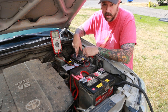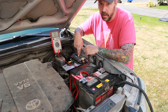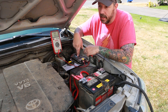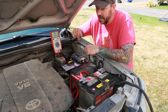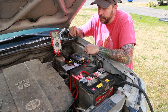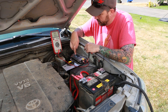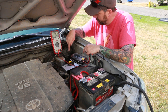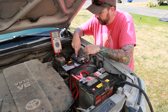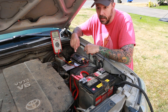Now we'll hook up our accessories to the block. I have two accessories that I've actually unplugged from the battery terminal that I'll get hooked up to our new fuse panel, and in the future we'll have other accessories. I don't know how long I'll run this setup because there are several items on this truck that are going to need a relay, and I don't want to be running a ton of wires up to the cab for switches. I could go with an S-Pod, but I really can't justify the expense, and everything the S-Pod does I can do for a fraction of the cost. Eventually I may end up building a different bracket in here to have a relay bank, but I'll still use the same fuse panel and same circuit breaker.